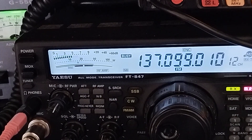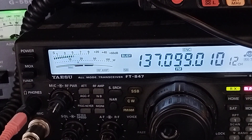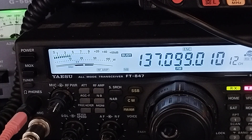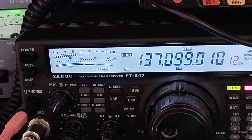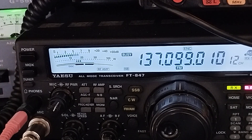I'm using the ham radio equipment which is the Yaesu FT847. It's connected to my computer with a USB lead straight into the CAT port of the radio, which allows the radio to be controlled using tracking software called SATPC32. That steers the actual frequency of the reception automatically and also controls the rotator system, putting the antenna in the correct position at all times.